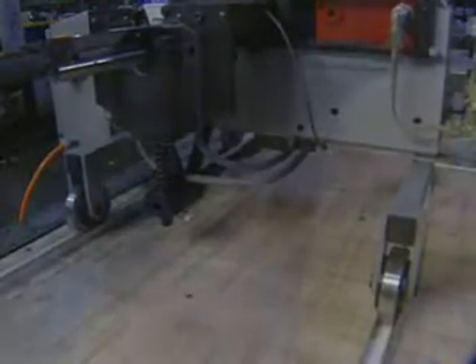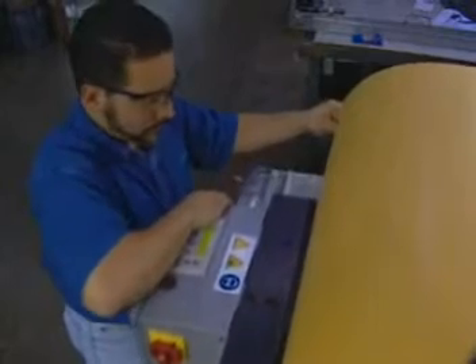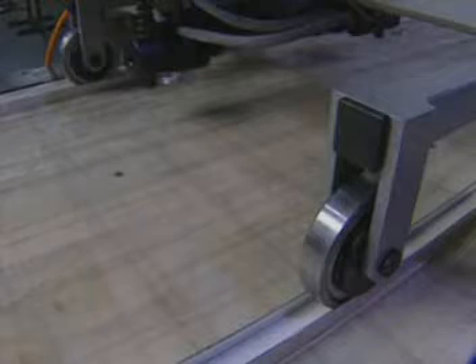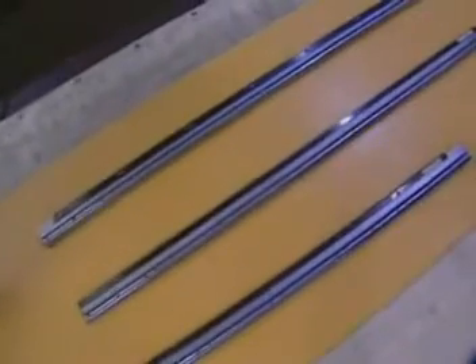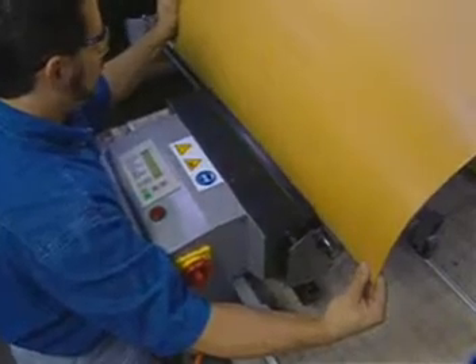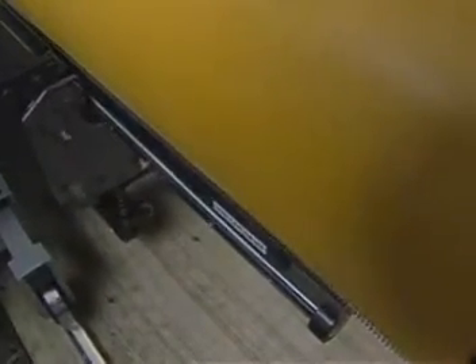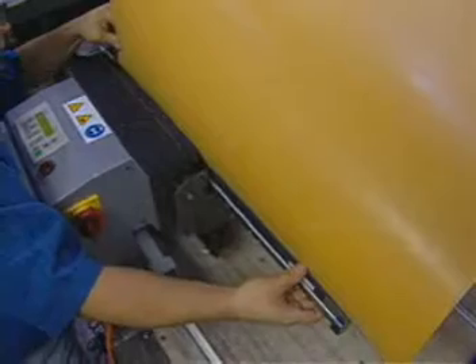The Pro 600 and Pro 6000 lacers have four wheels at their base, to allow the user to index the lacer down the table so the belt and comb can remain stationary. Many users create tracks on the tabletop for the lacer to roll in. During installation, the operator will close the jaws to install the first 12 inches or 300 millimeters, open the jaws, move the lacer down 12 inches, and close the jaws once again. The operator continues this process until the full width of lacing is installed.